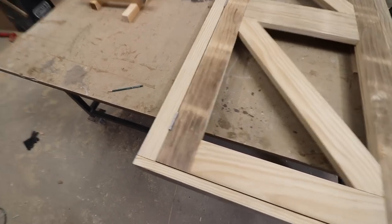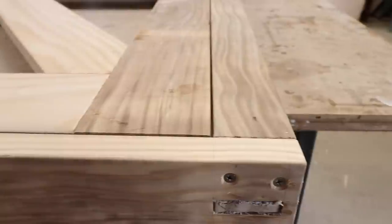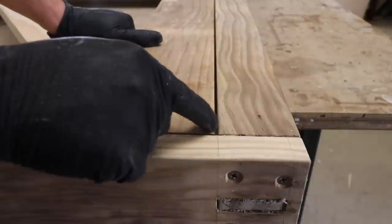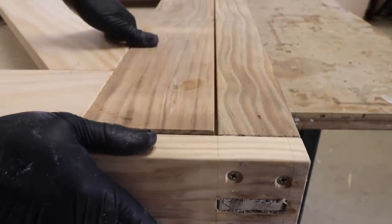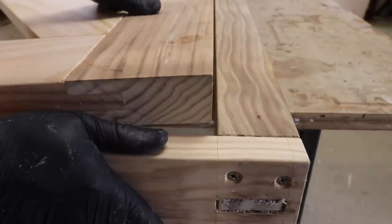Little gap on the hinge side, even with the closing side. So run it through the spindle to take a leading edge off. What that gives us is a nice clearance on the edge of the door here. So the gap doesn't get tighter, it's actually, as the door opens, it clears more gap